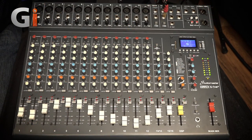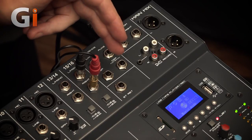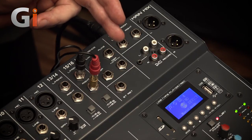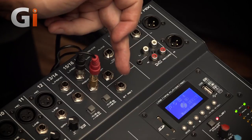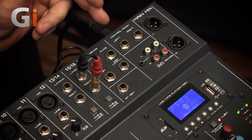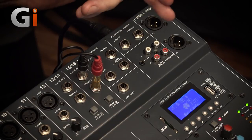On the output section, there's aux 1, aux 2, and an output for the DSP bus as well, so you can get your wet DSP send to an external unit. There's also a footswitch that cuts off the internal DSP — obviously you don't want reverb or a phaser on your voice while you're trying to make an emergency announcement. When you're running to an external effects unit, you can bring it back in on the stereo return, which goes straight to the main bus through its own fader. You've also got control room outputs left and right, so if you're using this for some home recording, you can have your monitors independent of your main outputs.